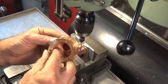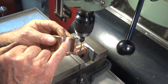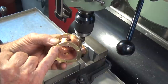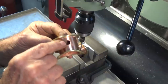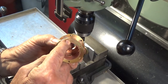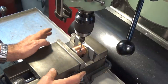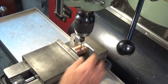Okay, this is today's job. I've got to drill two holes here diametrically opposed and they have to line up precisely with the features that are already done. I already have these drilled holes in the bottom flange, which is aligned in a particular way, and I want these drilled holes — which are going to take some fittings — to line up with that already drilled hole and the curvature of the base. When you look at this you might say Mark's lost his mind, but it's surprisingly difficult to set this up.